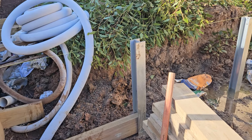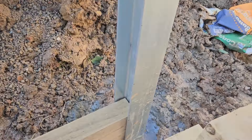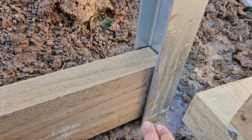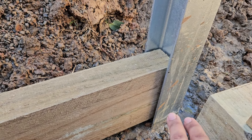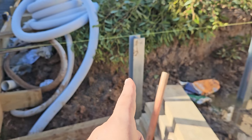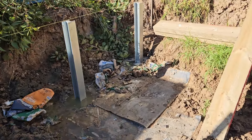I marked it to avoid over-covering. Look — there is a mark. We did the marking because when you fill with concrete, you should avoid concreting over the one-meter section. We are installing the first sleeper, and every 1.2 meters we install a post. We also check by line.